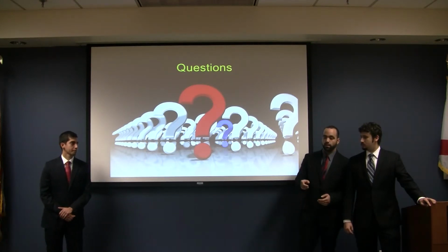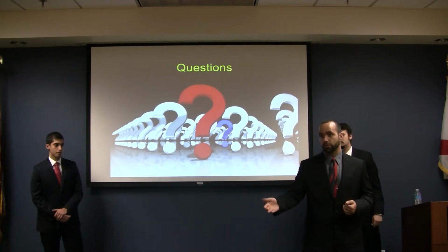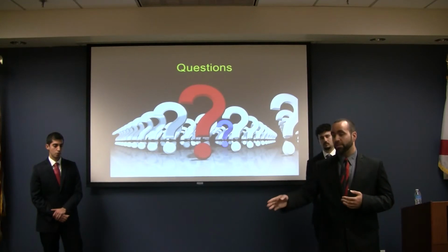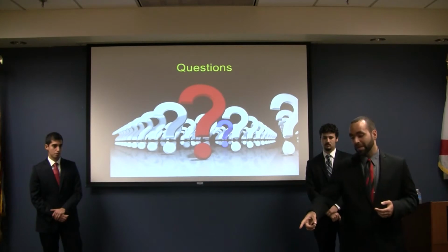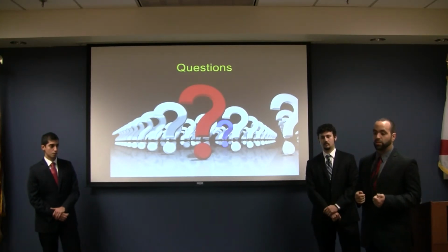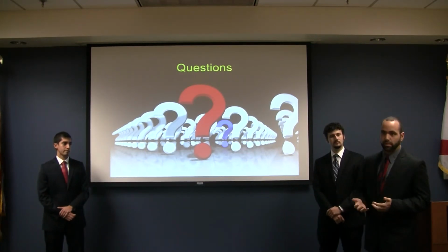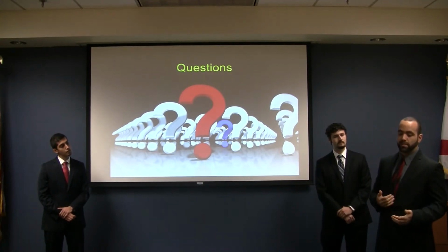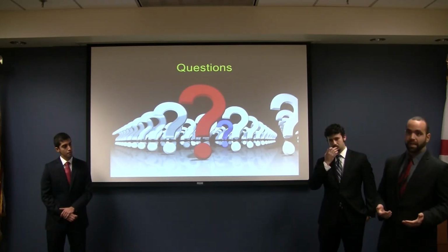We knew that because, like I said, we didn't go into the simulations until after the first run, so we kind of had an idea of some of the stresses going on. For the material, we weren't concerned, definitely with the aluminum. With the plastic, like I said, with the ABS and PLA, we were a little bit concerned with the chemical resistance, and just because we're using plastic on a manifold, we did basic tests just to see if it would hold up. Again, this is a prototype, so we really were just testing the flow characteristics. For long term, this would have to be cast out of another material.